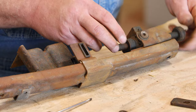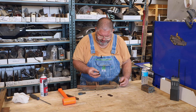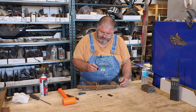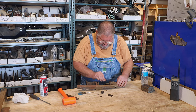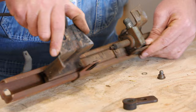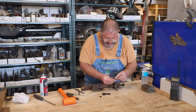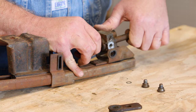For a part like this with rubber pieces — if it's a part we can't supply and you're giving up hope on finding it — visit the plumbing department of your local hardware store. There are often bits and pieces that can be substituted for parts like this. We'll remove this mechanism here — this is the drive mechanism — held in by two allen head screws with a kind of special head and little internal tooth lock washers. Just so things don't get lost.